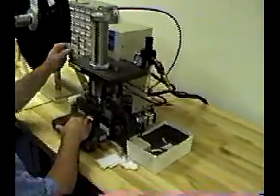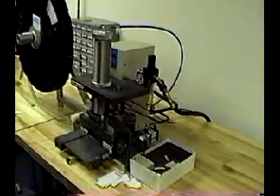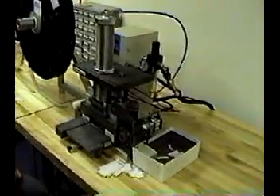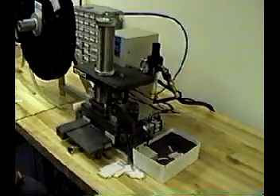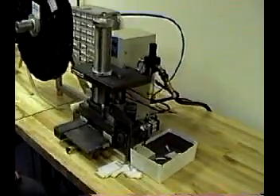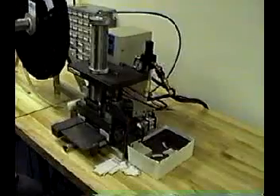The Crimplex machine itself is a very solid, very simple machine. It basically uses the large air cylinder that you see there, which brings a hardened steel die together with another flat surface and crimps whatever is in between it. It will crimp any number of contacts up to 26 on our standard machine, or up to 36 on our Deluxe machine.